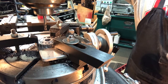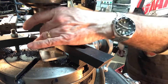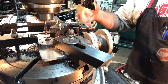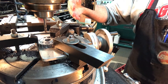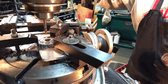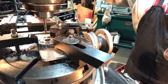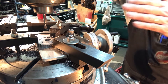The depth is something they don't talk about in the book, but basically the depth of cut from the outside edge of the cutter is about a sixteenth of an inch. I set the cutter next to the edge on the X-axis, raised it up, fed it in a little bit, and set it down — and sure enough it was just about sixty-two thousandths. I think that's a really good depth of cut and it will allow a nice grip for the rotating stake plate.